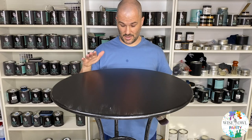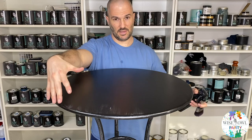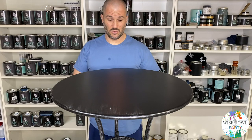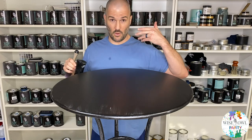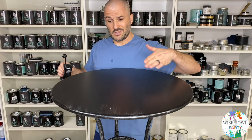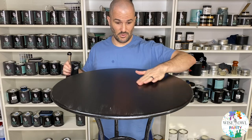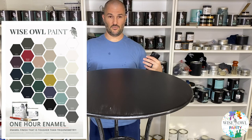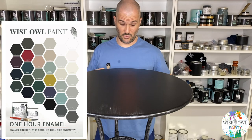I decided, nope, I'm not going to mess with it. I'm going to come back and finish the spots I missed on my second coat. That's exactly what you want to do, because you do not want to keep going over it and over it — it will dry while you're doing that and you will leave brush strokes. Then you'll be stuck having to sand in between coats. And as you can see, I'm not going to have to do anything. Look at how beautiful that is — beautifully flat and perfect and wonderful. If you're looking for a one-color finish where you don't have to do anything else, that one-hour enamel is the way to go.